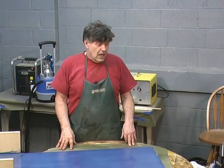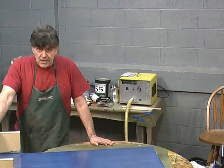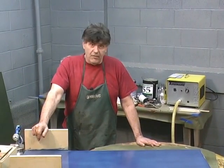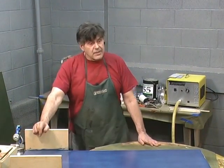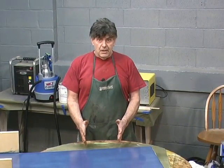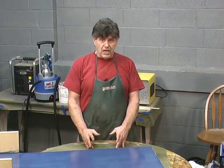Works great. Tell you what else it does too. Works well in solvent base. But again, set it in hot water, and for goodness sake, don't get solvent base anywhere around the flame. A lot of guys will tell you use a double boiler, you know, where you got a pan and you got water in it, and then you got another pot in it, and then you set the can of finish in that.